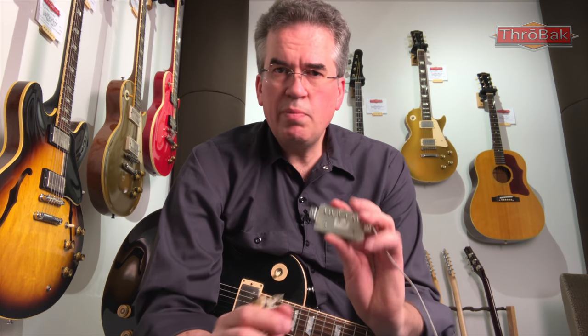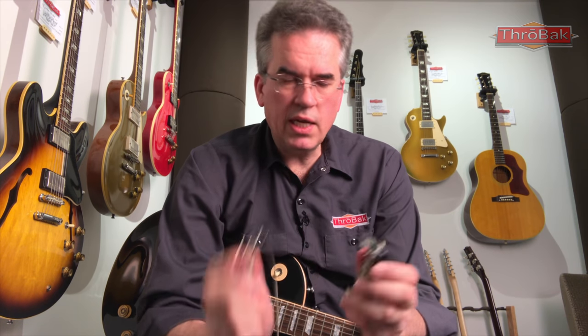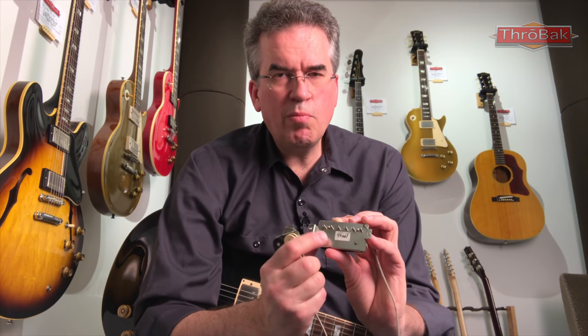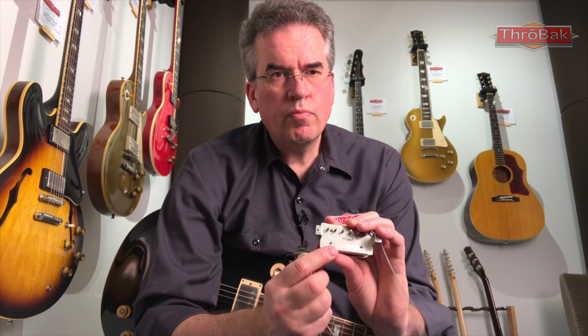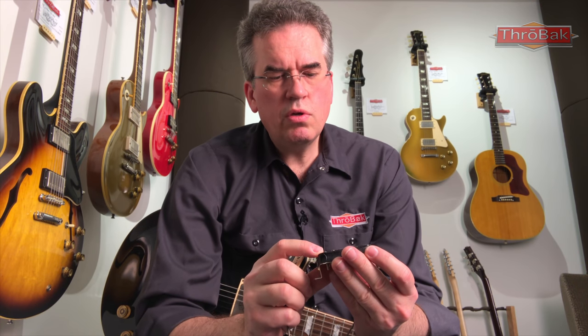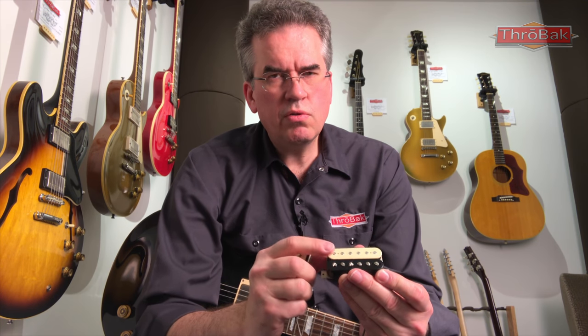Following that line of thinking, there may be a difference with steel and brass in a PAF as well. These screws are much smaller in a PAF than in a P90, but there are four of them in a PAF versus two in a P90 — and if you line them up, the actual metal mass within the pickup is pretty close between the two. These pass right through the bobbin from the base plate to nearly the top. So in terms of inductance and magnetism, there should be a measurable difference with steel versus brass.